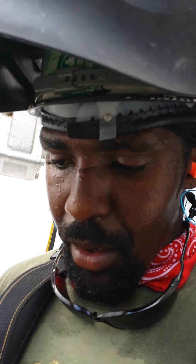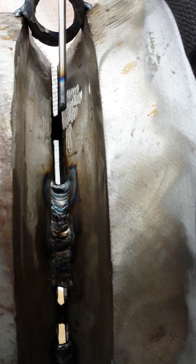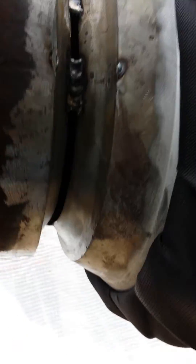It's like a carbon alloy rod. What I'm welding on today is a 10-inch heavy wall carbon pipe. It's preheated to about 450 degrees, give or take. This right here is a 5/32 gap, at least in some places. Some places it's actually a little bit wider — might be a 3/16 at the bottom.